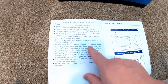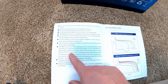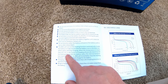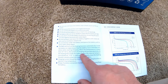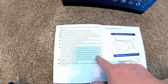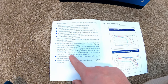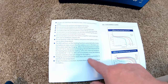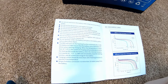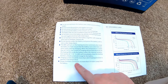The BMS will turn on the heating function automatically inside the battery to make sure it runs in the best condition when starting charging. When the temperature is lower than 32°F (0°C), the charging current will provide electricity for the heating film inside the battery. When the internal temperature reaches 41°F (5°C), the BMS will close the heating function and all current will charge the battery. Charge current should be more than 10 amps if the heating function is active.